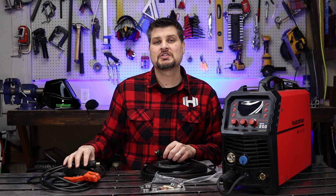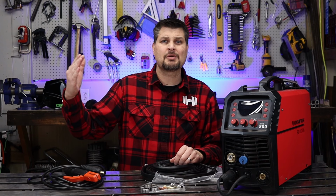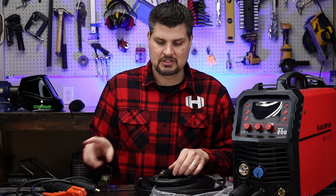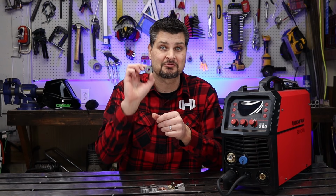This I bought separate. And for some reason, when you search for a manual valve TIG torch with a 50 DINSE connection, they're a lot more expensive. So what I did was I bought a manual valve 17V TIG torch with a 25 DINSE connection, and then I bought just some spare 50 connections, swapped it out, and it will get you TIG welding in no time. They do throw in a couple extra consumables, tips and nozzles, and a bucket load of rollers. So they got you covered.